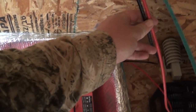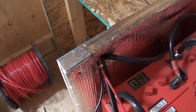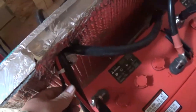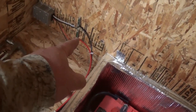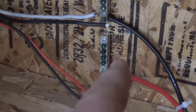The other part is connecting the charger and the inverter — I'll show those actual connections in a later video. These wires here are coming from my charge controller. I'm going to have the positive connected here and the negative going over here on the opposite side. I also have two other four-ought cables: this one goes to my positive and this one goes to my negative, and the other side coming out through the wall is going to my inverter.